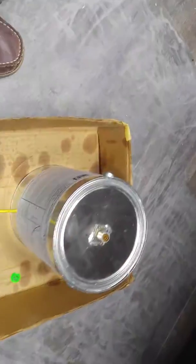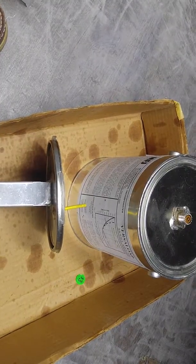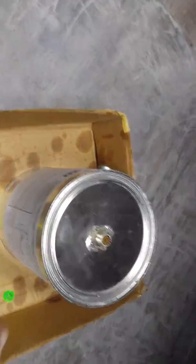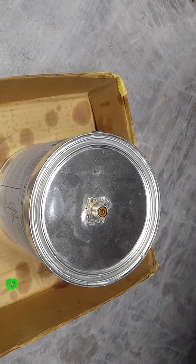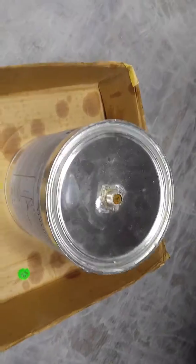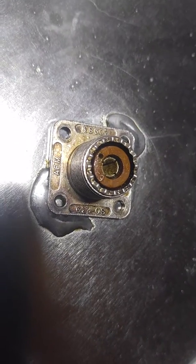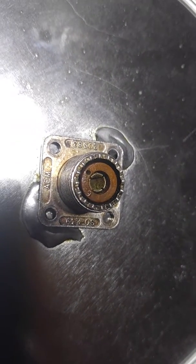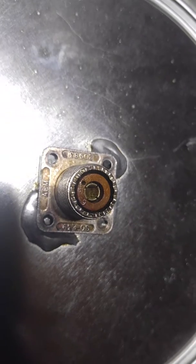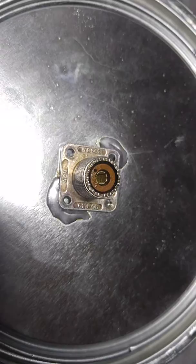The derating chart is not really very effective because I'm only using a portion of the oil. So what I did is I took the resistor out, got myself another lid, drilled a hole in it, and soldered an SO-239 connector to it from the bottom and from the top. To make a vent, I put a number 60 drill bit hole through the connector as a breather, so it has a vent and won't be slopping oil all over the place.